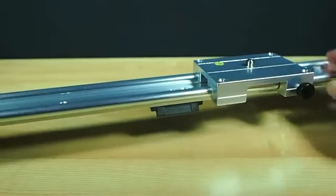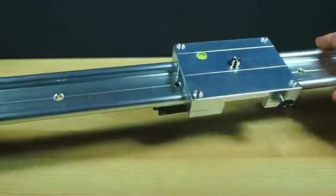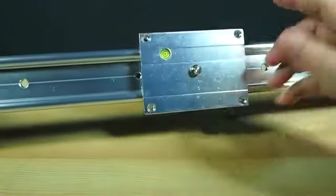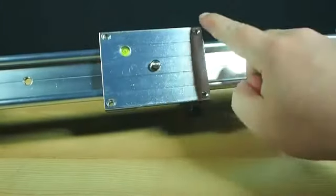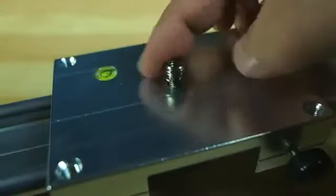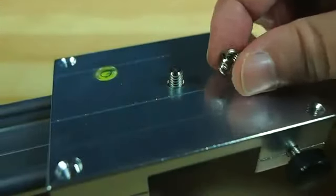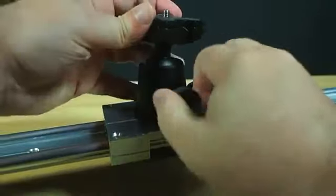The sled, like everything else, is carved from a single piece of aluminium, and just in case the American audience are getting annoyed now, aluminum, making it ridiculously robust. It's got a mount point at each corner for directly attaching a quick release plate, and a central mounting thread for attaching pan heads and ball heads to, and it will accept either the larger 3/8 thread found on more pro gear or the more common standard of 1/4 thread.